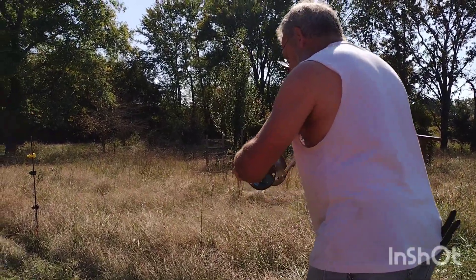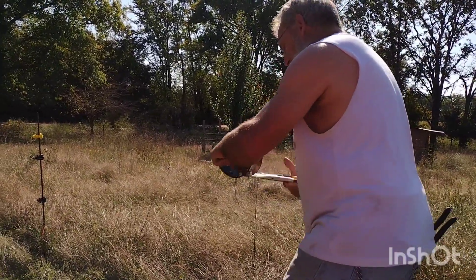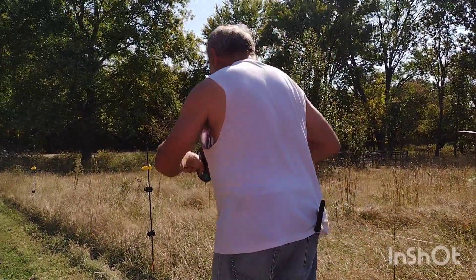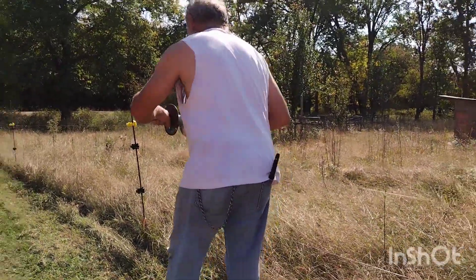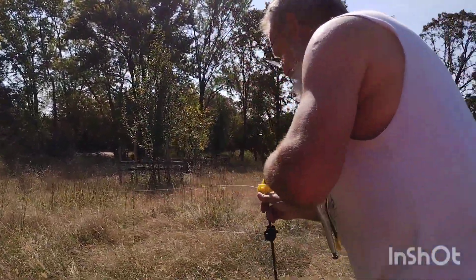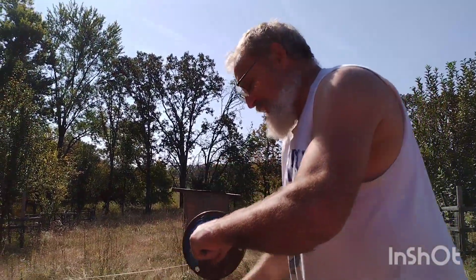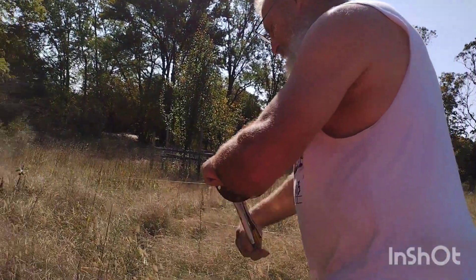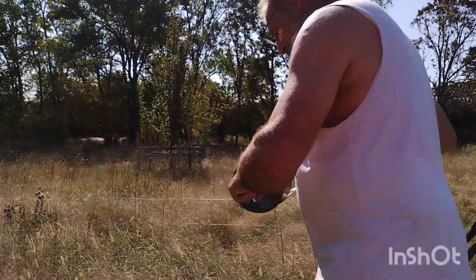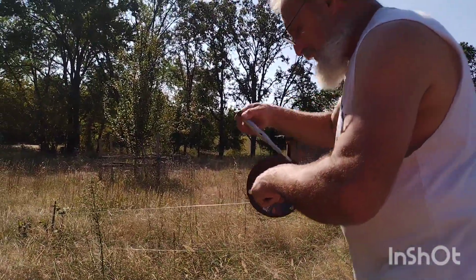You obviously don't want a lot of breaks in the strands. I'll get down here in a minute and cut it off and show you how I splice it. This is steel wire, 17 gauge, and it lends itself to re-usability. It's not very mobile, but that's the advantage of poly wire — it's mobile. Plus with the poly belts people can see them better. But this allows me to re-utilize that bit of money spent on wire.